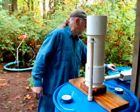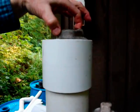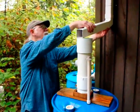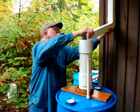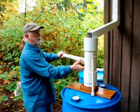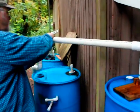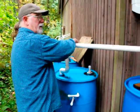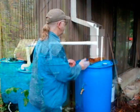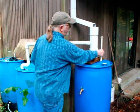We put our adapter on top. Remember there's a little groove inside here — this is the top screen, it sits right in there. Now we put the downspout on. We have our output pipe that's going to hook up to the storage barrel, which is also vented, and we are done. The water comes down from the downspout, goes into the standpipe, goes down through there — there's a float valve assembly on the bottom, and this is the vent.